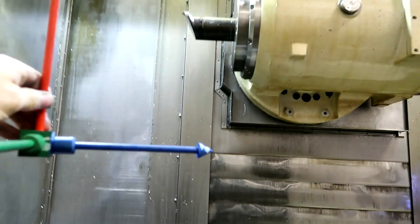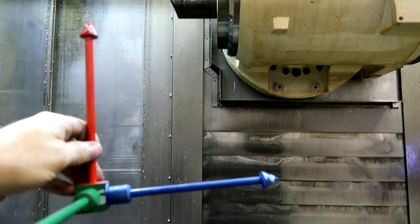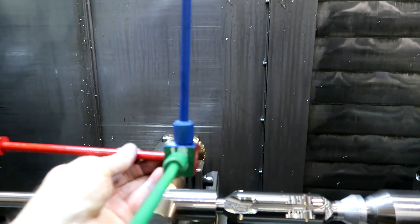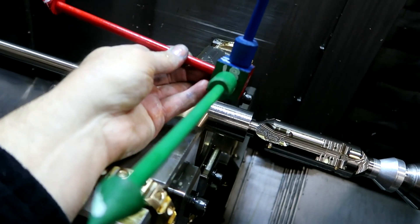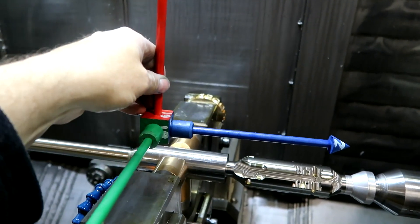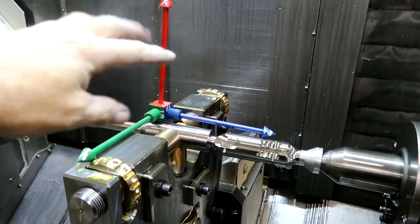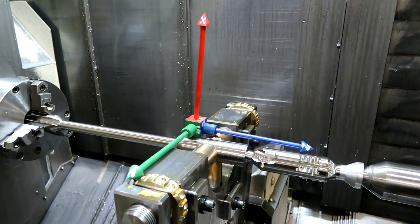So right now, if you're looking at it up there, the Z is facing this way, but as you rotate that, it comes around and you rotate it in the program. So you're really always milling in the XY plane with these machines when you're milling, unless you're doing a full five-axis move. Then you're just doing a bunch of little line segments, and you don't actually rotate the coordinate system for five-axis work. It's just all around the world coordinate system.